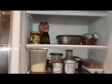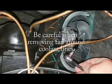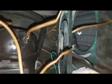Okay, so before we go and disconnect the fan, open up your refrigerator and go to the unit off button and turn your power off, so that your refrigerator's dead, so you don't accidentally shock yourself or anything, or it actually come on. Now we're going to come up here, and I have a 1/4 inch mini socket set, and I'm going to use that to take these 3 screws out. Okay, I have now removed the screws from the fan, and now I'm going to come down here.